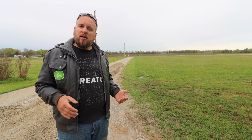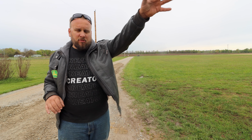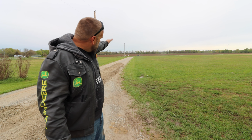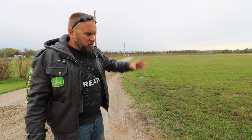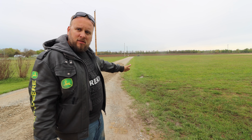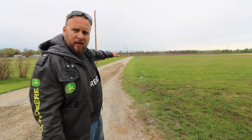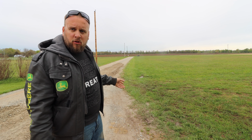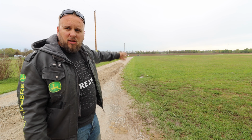Alright, so I'm down here at the driveway and I'm getting ready to take a lot of that French drain pipe, and I'm going to run a drainage system that drains off the hill, down the yard, to here, and all the way down the driveway to the ditch. Water already tries to flow here because it comes down the hill, then it meets the crown of the driveway and can't cross that, so it has to flow down here. So this turns into a river. It also kind of turns into a lake in this area over here when it's been really rainy.